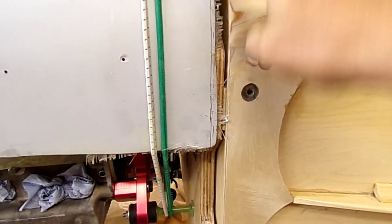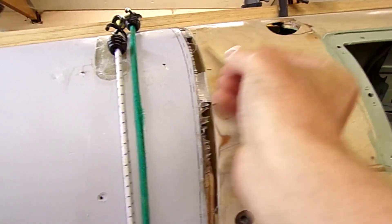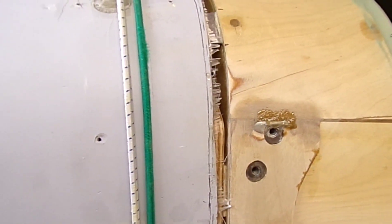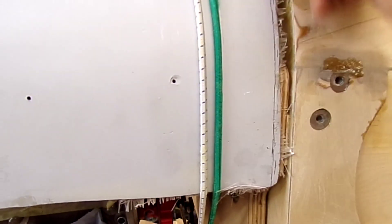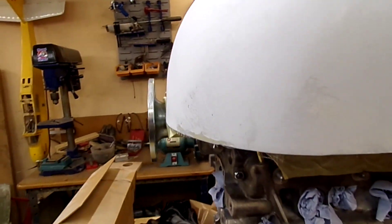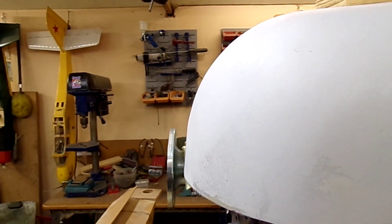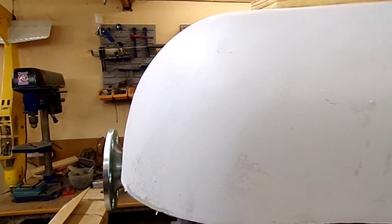I'll then start trimming all this back to get everything to fit in line with the top, and we can start making progress along the edges. You'll probably see this line up here — all I used to get the line was a lollipop stick. Stick it on there, pencil up the side all the way up. You might be able to see a dotted line to one side — that was going off the widest point, but on the other side the corner is out of position. That's the width I've got, so that's how much I'm going to trim off. It'll bring this back by the width of the lollipop stick, which puts it just about the right place for the prop drive, although looking at the front it's got a slight tilt outwards — not sure how easy that's going to be to correct, but we'll find out.